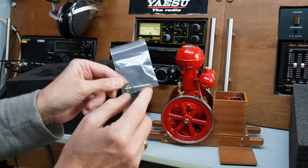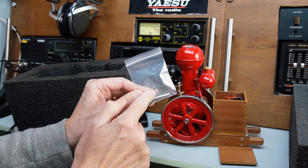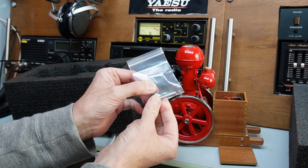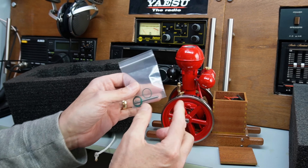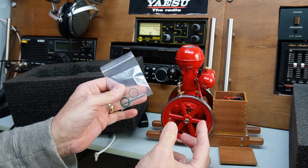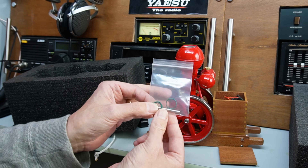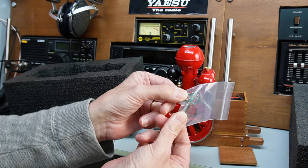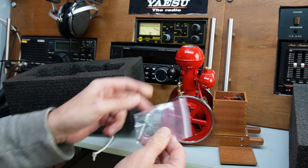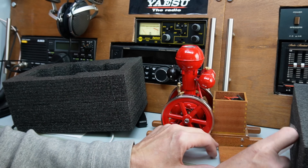There's a little bag of spare parts. The cylinder — you should never have to change it — but it does have a nylon piston ring. Someone said it should really be a metal ring, but then you need oil control and everything. To be honest, I can't see these ever wearing out. We also have a little key here that will go into an electric drill and fit onto the flywheel to save you spinning it over by hand.